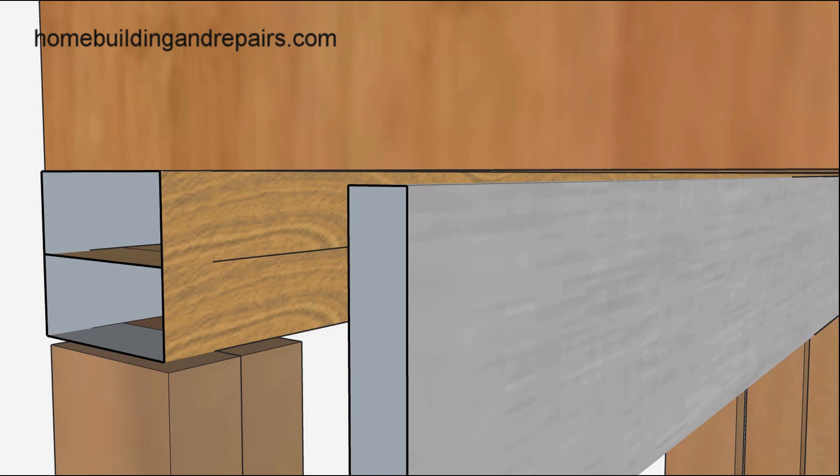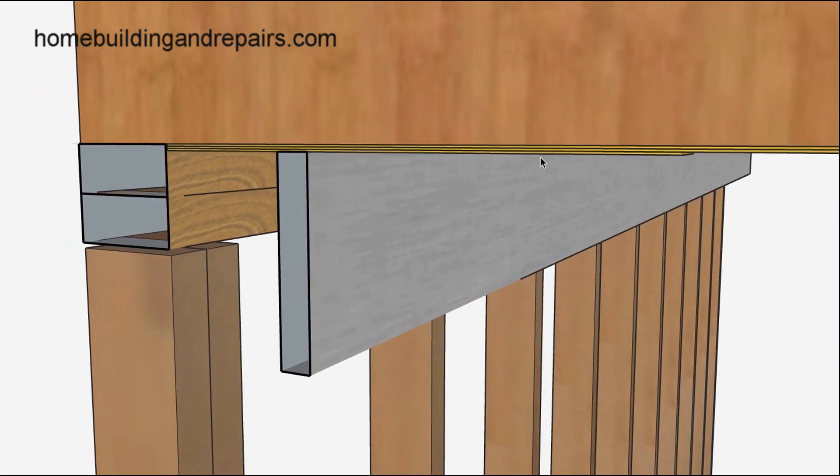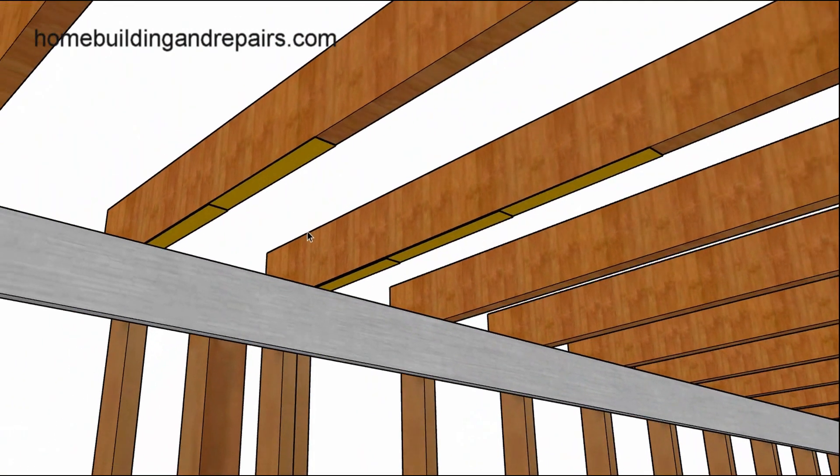To fix the variations, they sell some cardboard spacer strips — I think they're about a sixteenth of an inch wide — and you simply staple them on to the framing members, joists, or wall studs.